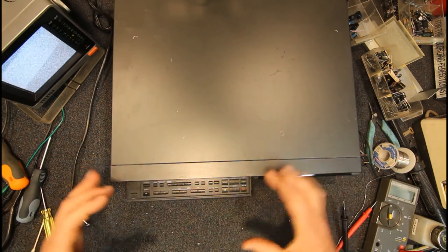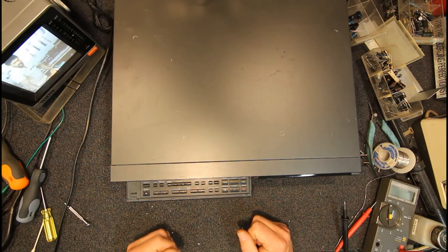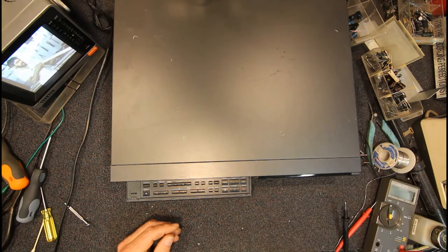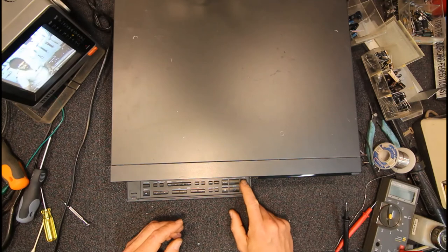There was a big slide plate underneath that ran all the mechanism. They used to snap. The little pulley on the motor used to break. And I don't know if there was anything in those that didn't fail. They used to have thick film modules that the capacitors would fail on, and lots and lots of trouble with those machines. I think possibly the caps and motors may have gone in them as well.